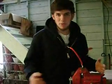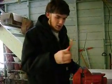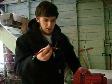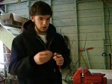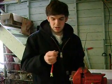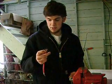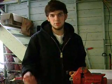I'm putting quite a fair bit of pull into it and it's not coming out. The professional crimp and the home-done solder are both holding just as well — neither of them pulled out. But I definitely prefer the solder because it looks nicer, you can fit a boot on it easier and cleaner, and if you ever need to reuse it you can just heat up the solder and pull the terminal off, because terminals aren't cheap. Hopefully this guide gives you guys an idea of what it means to crimp or solder on terminals. See you guys later.